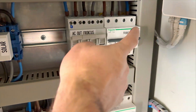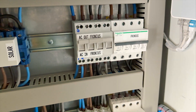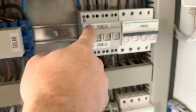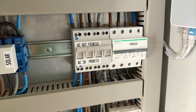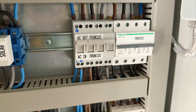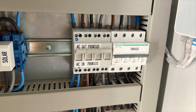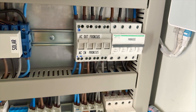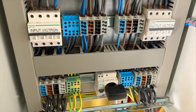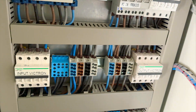Now let's talk about the Fronius switch. As you can see, we have protection for the Fronius and we added a switch that also has a trip position. This gives us the ability to move the Fronius to AC out: when the switch is in this position the Fronius is in microgrid connection mode; if we move the switch down, the Fronius becomes a standard on-grid inverter and will go down when the grid goes down. We have Victron on the input, Victron on the output, and distribution blocks to manage all these energy flows.